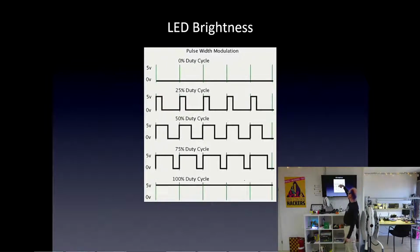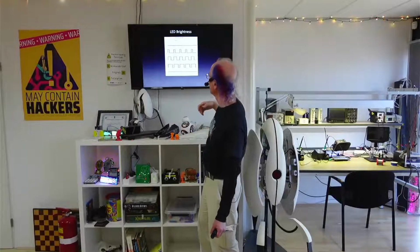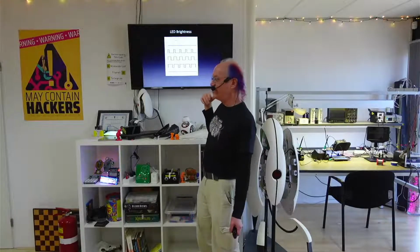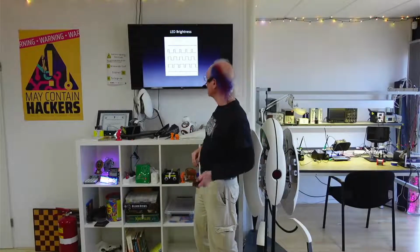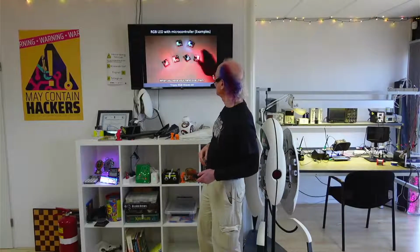But we can have arbitrary on-off times, and the on versus off time is called duty cycle. That's a fancy word for it. If it's on all the time, that's 100% on, 100% duty cycle. But we can also have, you know, like 62.347%. We just have to have the on versus off time what we want. We usually don't care about so much accuracy, but for doing audio, we do care.